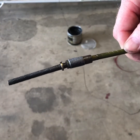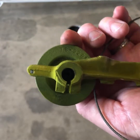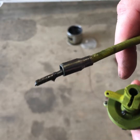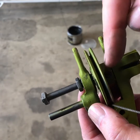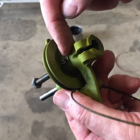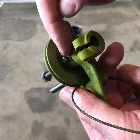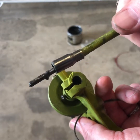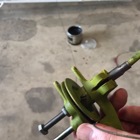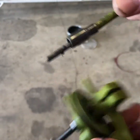This is the end that goes out to the elevator. You can't see it again for the lighting, but inside the shaft has a square hole that a speedometer cable — more or less — goes into. The only thing that's tricky is the screws. The shaft goes through the pulley and actually has holes in it that these screws go through. The screws lock the pulley to the shaft, but also when you insert this square tip into the shaft, those screws go through all the way and pinch this shaft right here, locking it all together.